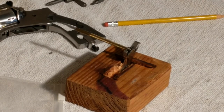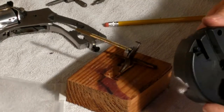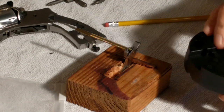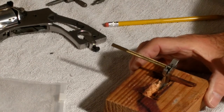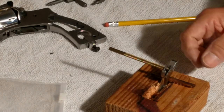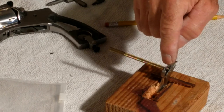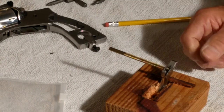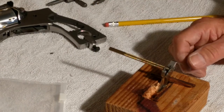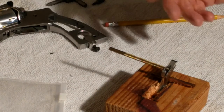Okay, I'm back. So I went off camera to figure this out. Remember, guys and gals, this is the first time I ever did this. And what I came up with, first I tried using this, it's called a bench block for gunsmithing, but it did not have any slot or hole or anything where I could use, so I made one out of a piece of wood. I just carved a channel in it so that I could shove the trigger down there, and that would take the place of one or two of my hands and hold it in place so that I could push down on the trigger spring, thereby compressing and spreading the legs, if you follow me, and then get my drift through there. That's like stage one. Now I've got to replace the drift with the little roll pin.